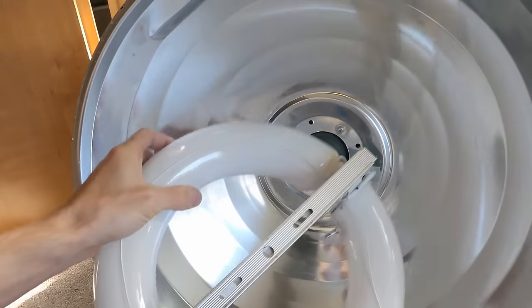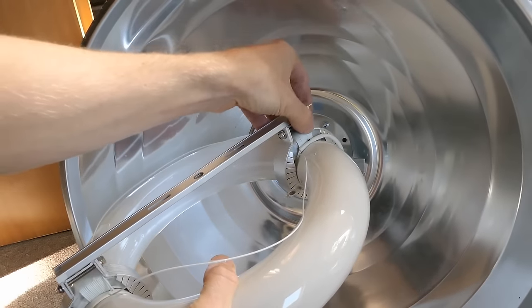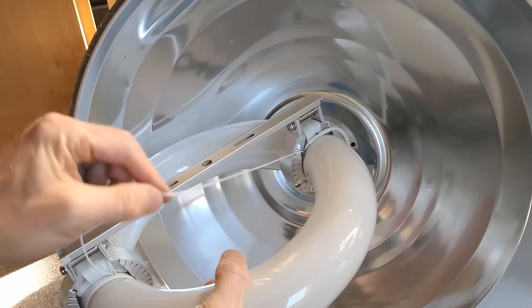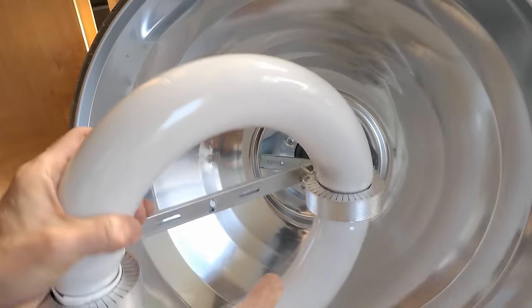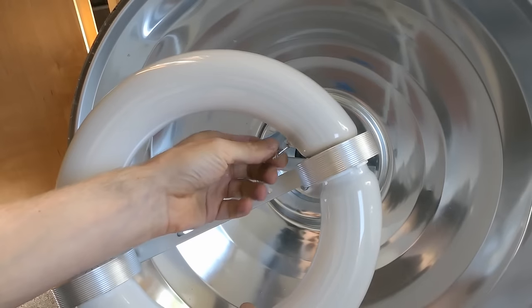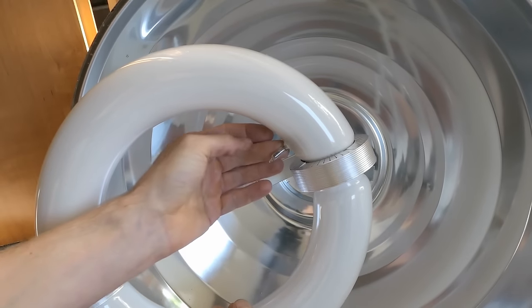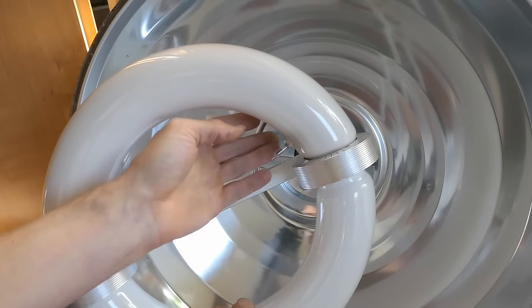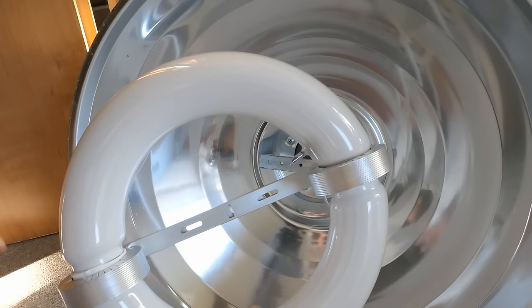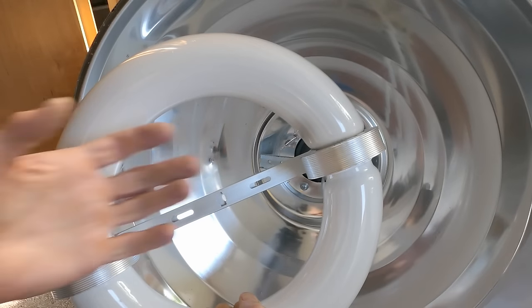There is some interconnection between one ring and the other, and they have some winding rings on them which are probably in series. Here is the evacuation stem of the tube with an amalgam pill or mercury dispenser. These things really contain just a couple of milligrams of mercury — it's not like the entire thing is full of mercury. It would be almost heavier than me.